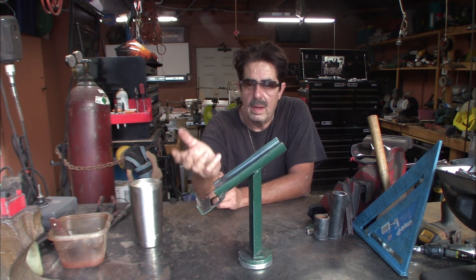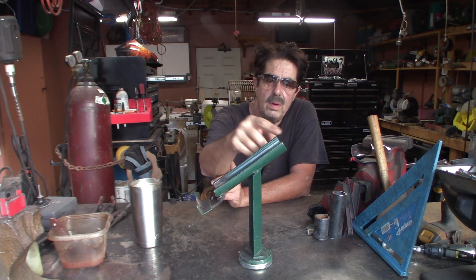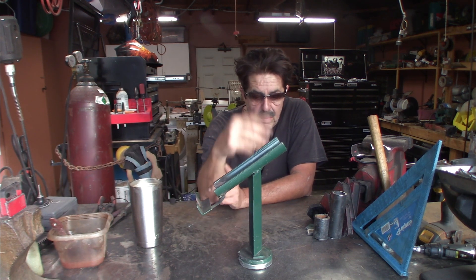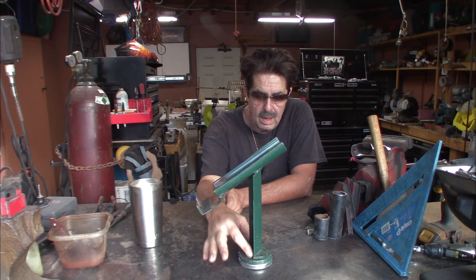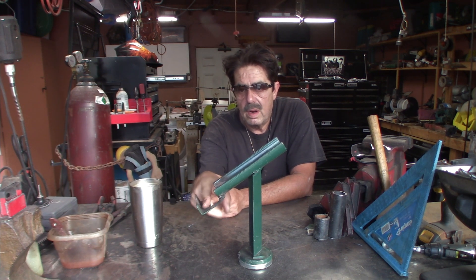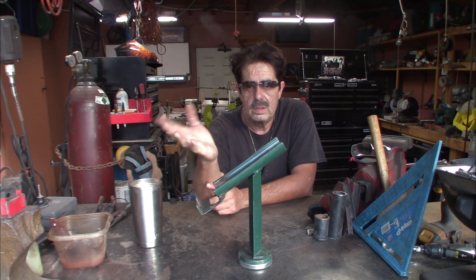It's made out of scrap metal and it comes in real handy. This first piece of pipe is about two-inch ID, cut in half. There's a piece of angle iron — scrap bed frame rail, whatever you want to use. Down here is a little piece of plate, and I welded it onto one of these Harbor Freight magnets. You can make a little tray here if you want, like I did, because it holds my oxy-acetylene torch as well as the MIG gun.